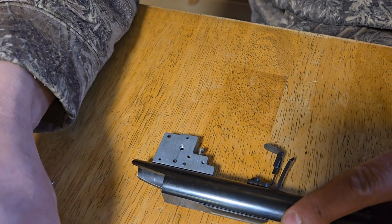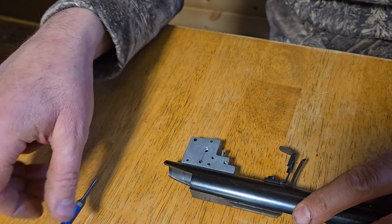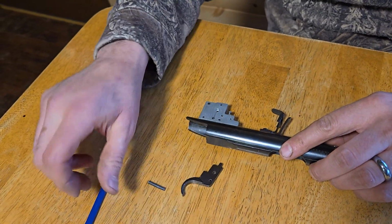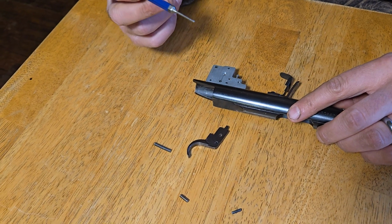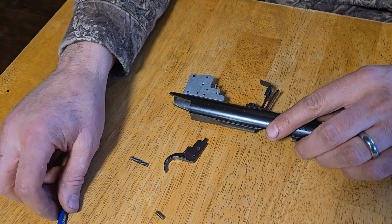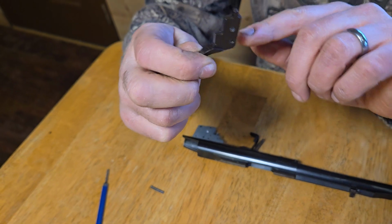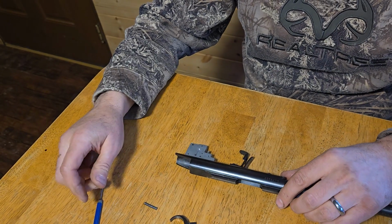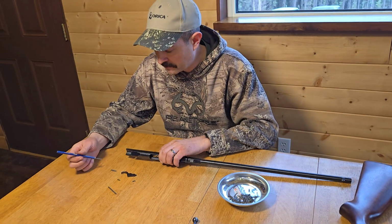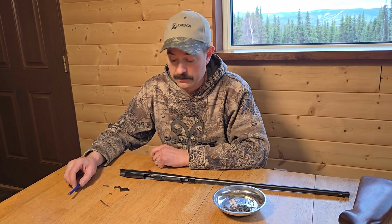So what I'm gonna do is I'm actually gonna use that larger portion of the hole. I'm gonna set this pin through the trigger, and then I'm just going to use some epoxy in there. And that'll actually hold the pin in place. So it's no real harm done there, but if you decide to do this, what I would recommend doing is using a standard drill bit until you get through the soft aluminum, and then switch to your carbide drill bit to drill through the hardened steel. I mean, it makes just a perfect hole through nice hard steel like that. But at any rate, yeah, pretty happy with it. I'm gonna reassemble this stock trigger spring, and have a nice 2 1/8 pound trigger pull on this 22.